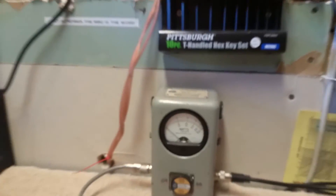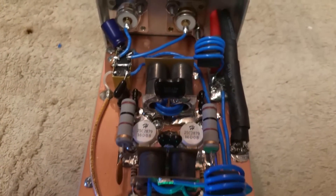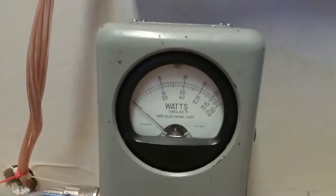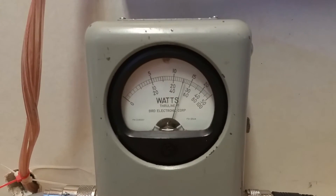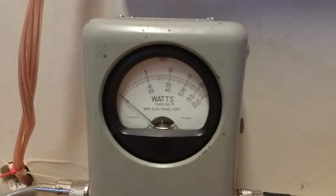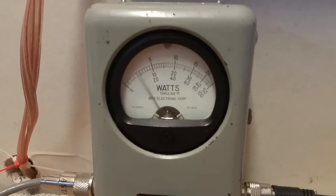Amp's doing awesome, very happy with these. They turned out great — got a low input reflection, and it shows it. Go ahead and dial our dead key down, see what it does. Look at that, 250 on the bird from nothing.